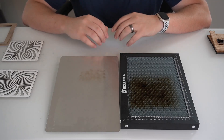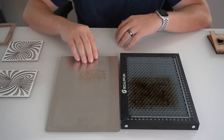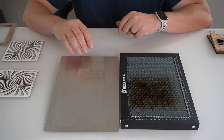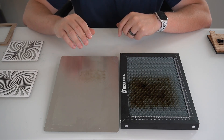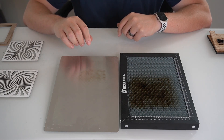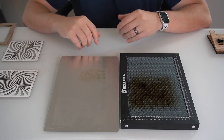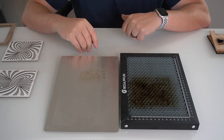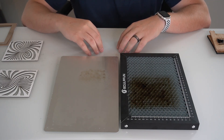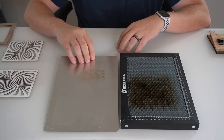First, I wanted to talk about what these two components are. If you're doing any type of laser work, I strongly recommend having some sort of base like this aluminum base, because even if you do an engraving where you don't expect it to cut through, accidents do happen. If you don't have a base down, you're going to end up cutting into whatever material is on your build plate. At least put some scrap wood underneath to provide a layer of protection.